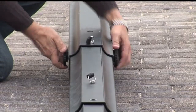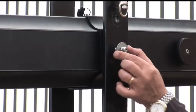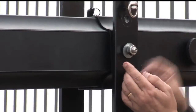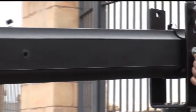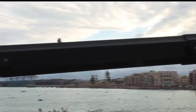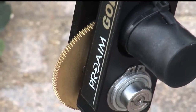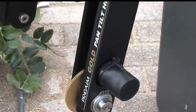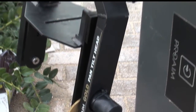Once you have completed this, you secure the tail to its stand and secure that too. At the back of the tail, you insert the stainless steel rods that will take the counterweights that you bring with you. At the other end, you install the platform to which you then attach the pan tilt head. This model is the gold pan tilt head. Onto this, you fix your camera and pass the necessary cables along the jib arm, which would reach to the rear control center.